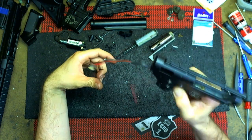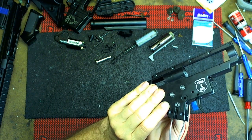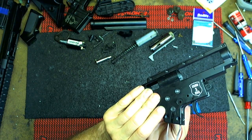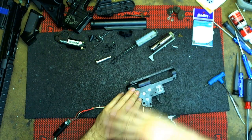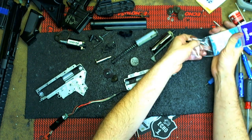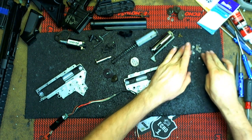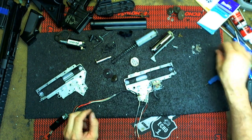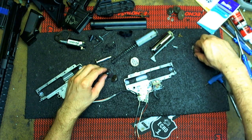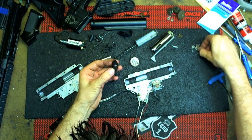Just because you can hear that. And if you press on — see how the whole unit moves? You have the bearing and the axle move. So that means I've got to add a bunch of shims on the bottom and the top to keep them all running smoothly. There are lots of ways to shim a gearbox. The main goal is to have it run smoothly without building up extra friction and noise. It takes lots of practice. Let me go ahead and just start throwing some shims on there.